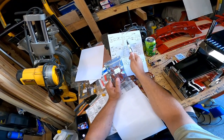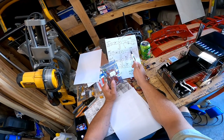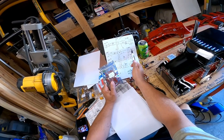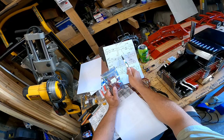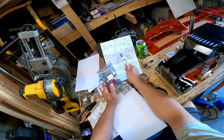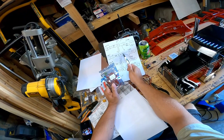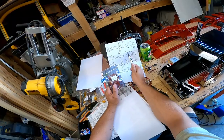So if I have a 120 ohm resistor coming out here to a diode that'll feed to that to light the string. Or, I mean, a diode and then a resistor and then feed out, whichever way. And then I send power here and I have a 50 ohm. It doesn't just use the 50 ohm. Now it's a combination because now the resistors would be in parallel.